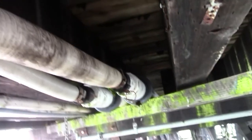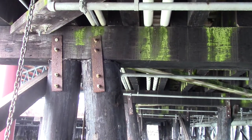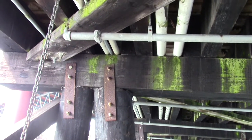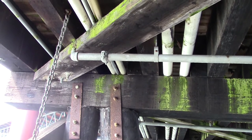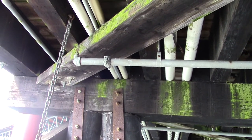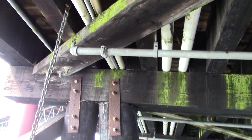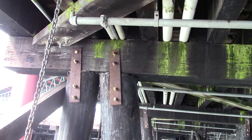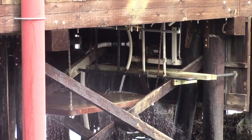From the pump, the water is pushed through more hose line and PVC. This section we actually use a duplicate system. You can see the duplicate system with the two parallel PVC pipes running along the bottom of the pier, just slightly right of center in the image. This duplicate system helps minimize the cleaning maintenance needed, which is really helpful as the PVC length is approximately 270 feet from the pump to the building. We are also able to utilize the duplicate system when we are done cleaning the main hose line — it allows us to flush the line, sending water to and from with the duplicate system, preventing it from going up into the building and into the exhibits.